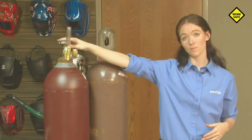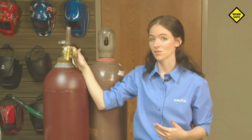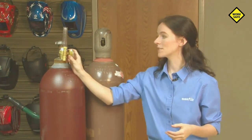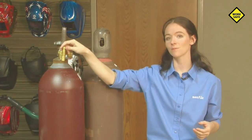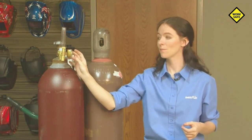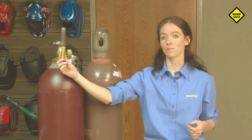Once this is done, you can open the bottle. Start with a small amount of opening to make sure there are no leaks, then open the valve the entire way. This is a double valve, so it will need to seat at the top, meaning it needs to be opened the entire way to get your full flow of gases. Once that's done, you can use any knobs or adjustments on a regulator flow meter to ensure you're getting your proper gas flow. But always ensure that there are no breaks, kinks, or holes in your lines — otherwise your gas is leaking out, and atmospheric air can get into your weld, causing contamination, porosity, and other issues.